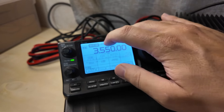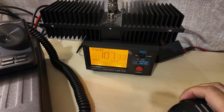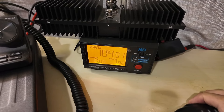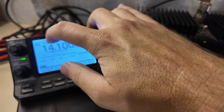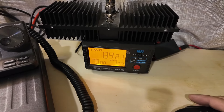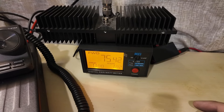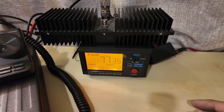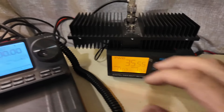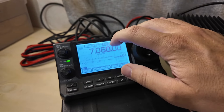Let's change bands to 80 meters, RTTY mode — 107 watts, I'll take that. 40 meters — 104 watts, I'll take that. 30 meters, RTTY — 105 watts, I'll take that. 20 meters, RTTY — 80 watts; I'd really like 20 meters to be higher power than that, but it's better than it was before, and it's better than a repair bill. 24 megahertz — 58 watts, that's pretty low. 28 megahertz — also pretty low. 50 megahertz — 75 watts. So 40 meters was doing pretty good, and 40 meters is still doing pretty good.